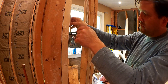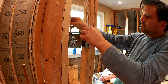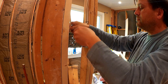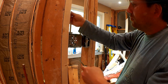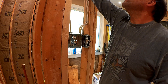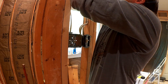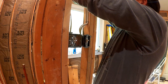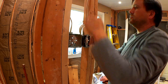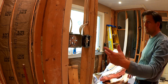I'm going to go ahead and tighten this down. You want it good and snug, but you don't want it too tight to where it's pinching really hard. So now that I've got it set up, we can go ahead and nail this into place. You just need to make sure that you're within 10 inches of the box — I like to be within six to eight inches.